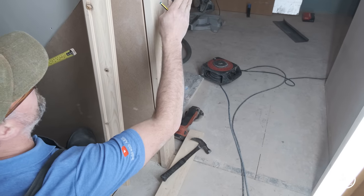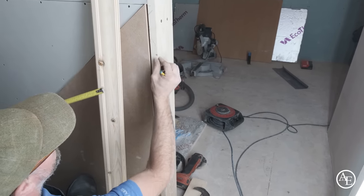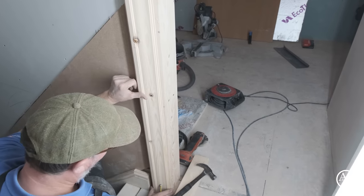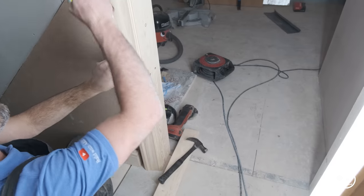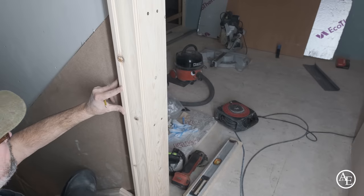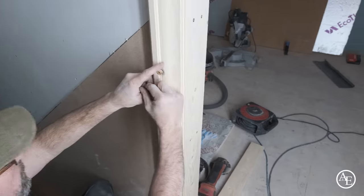Yeah, the door's opening in, so if the door's opening in, that means the slamming strip's going to be on this side. So if I make sure this architrave is just slightly nipping over, because it'll be a 12mm arc, won't it? So if I just mark that, there we go. That's good and level there. Look at that for an eye. That weren't bad, Al, was it? I'll get a couple of tacks in here.